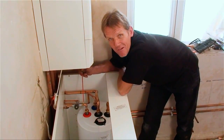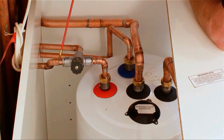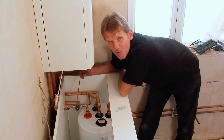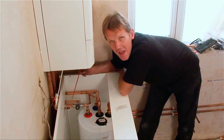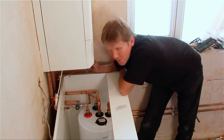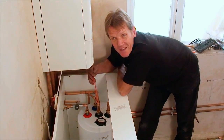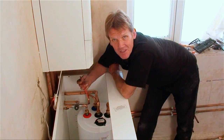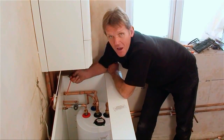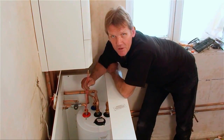So it's coming out a lot hotter than we need it, which is why we put this blending valve on here. The blending valve - we don't want the customer messing around with that. We're going to set that at around one and a half to two, giving us 30 degrees centigrade out of the blending valve. That will then go into the cold feed in the boiler, just as you normally would, but it's been warmed up. That's how we manage to get 18 litres a minute out of the boiler as a constant flow rate for even up to half an hour, because it's picking up this bit of energy from here and also from the gas saver.